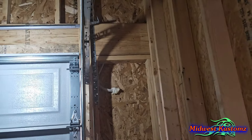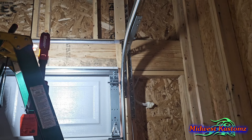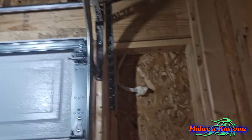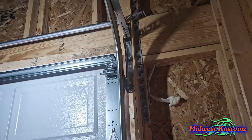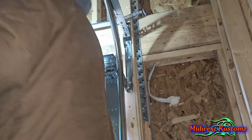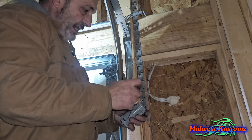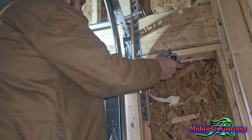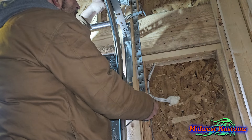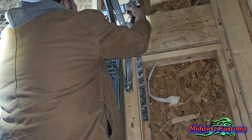All right, here's what this looks like. It's hard to show on camera. I'm going to grab my cable — I unloosen the screw on this cable drum, pull it out a little bit. The cable part with the slot goes to the outside. Bring it back over here and roll the cable up towards the back. Slide this over the spring — don't push your spring in. Do it carefully and make sure your cable is all on the inside over here.